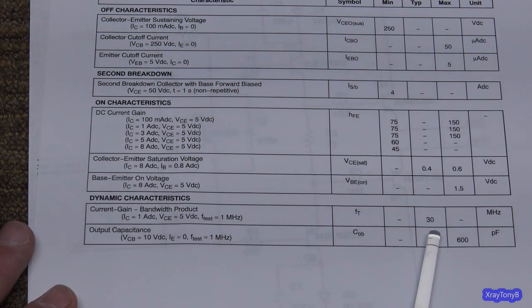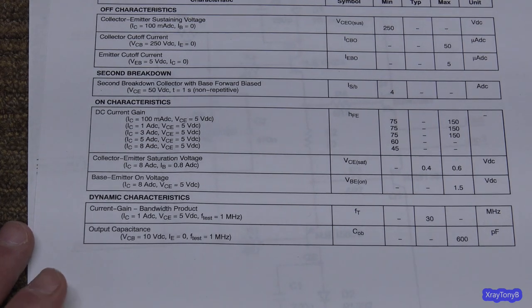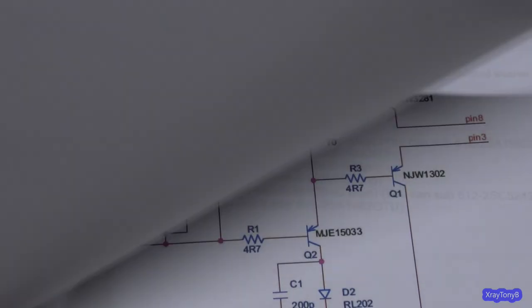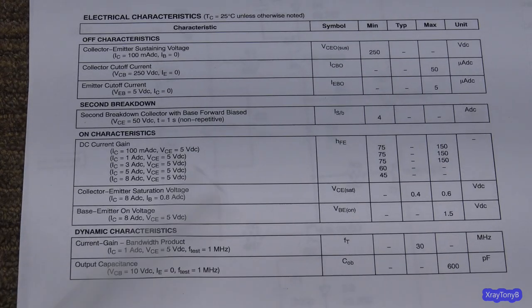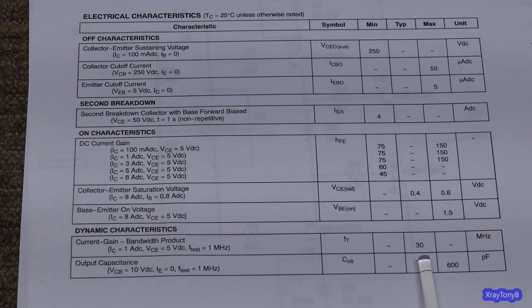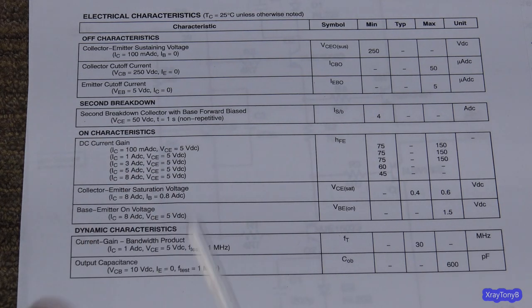The other concern is if you're replacing an old transistor that had a one or two megahertz transition frequency with a 30-megahertz part. This transistor will react to high frequencies much better. Little design flaws in the circuit that didn't matter before — for instance, if the amplifier can oscillate at 10 megahertz — a 2-megahertz FT transistor would squelch that oscillation because it can't react that fast. Whereas with this 30-megahertz part, it'll pass the oscillation right through and all of a sudden you've got wild high-frequency oscillation burning up the amplifier.